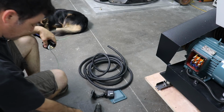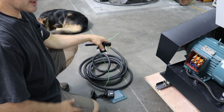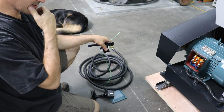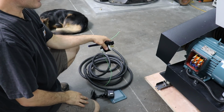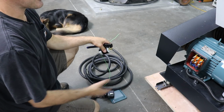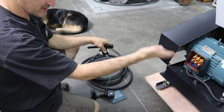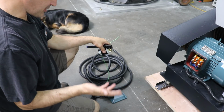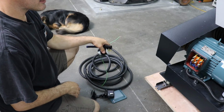And the whole point of grounding the motor is that, you know, if this motor seizes up and the coils all of a sudden get a huge influx of electrical current through its windings, those may heat up enough to burn off the insulation on the windings in the motor. And then when those burn off, basically the voltage will arc across to the case of the motor, creating a hot case, excuse the pun, but basically creating a 220 volt electric charge on the housing of the motor itself. So if you touch anything on the motor, any conducting surface, which is, it's a metal motor, or any metal surface or conductor that the motor is attached to electrically, and then another part of your body touches the concrete or any other grounded piece of metal, then you're gonna get shocked by a pretty decent amount of jolt.